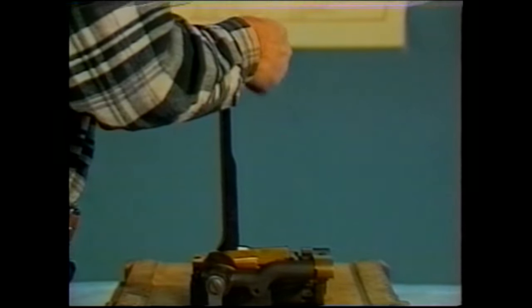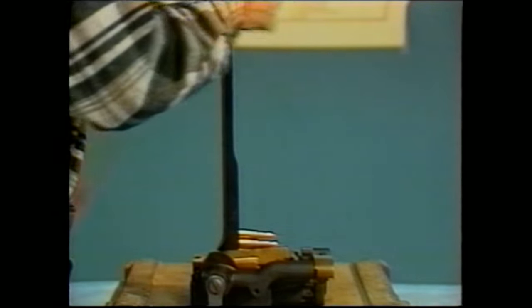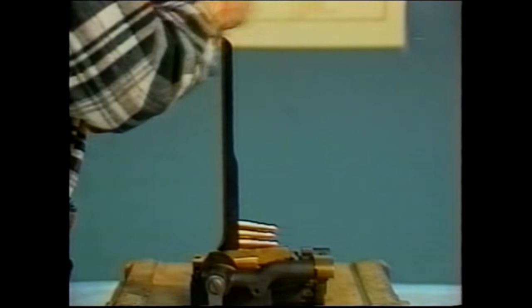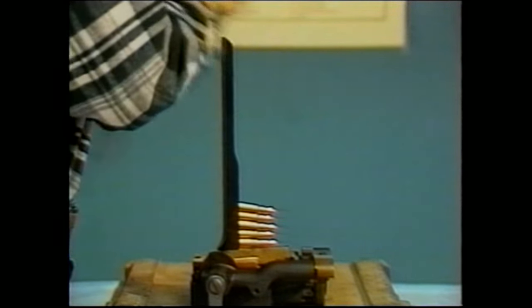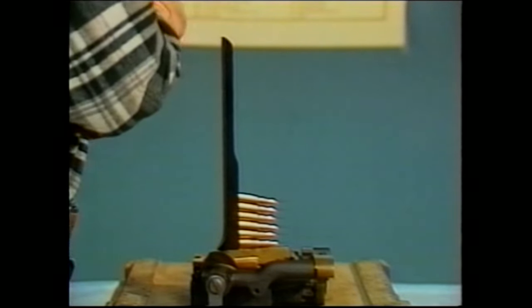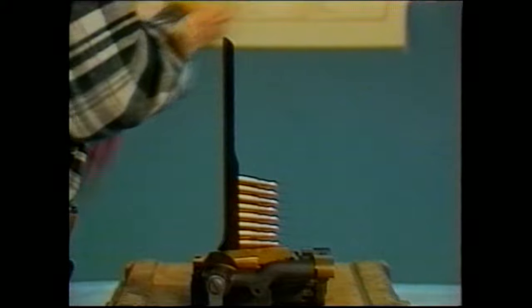Make sure that you do put a lot of cartridges on the slide. You don't want to just load three or four at a time, because the rhythm that you set up when you begin to actually load the belt is very important for smooth operation. If you jerk the belt loading machine around, you'll probably jam it. If you do jam the belt loading machine, stop, back up, reload the machine.